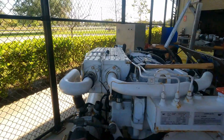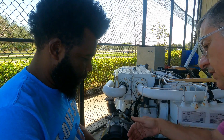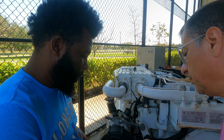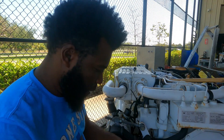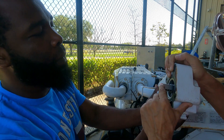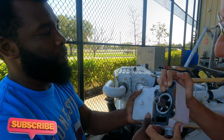Alright, Captain. What is this? The thermostat? Always when you order the thermostat, you receive the gasket and the thermostat, and the procedure is to put it back in the same position. Be careful — when you put it back, take a picture about this moment. This is the thermostat. It's not complicated. You can always mark it here. Look at this — this is Caterpillar, it's original, and the range of temperature of this one is 88 degrees Celsius. So that marking should be exactly the same on the replacement.